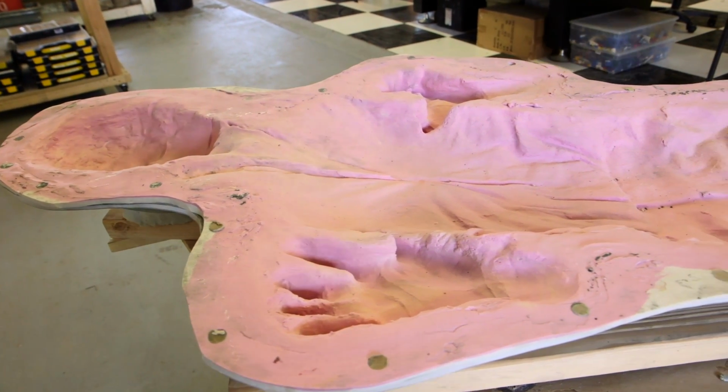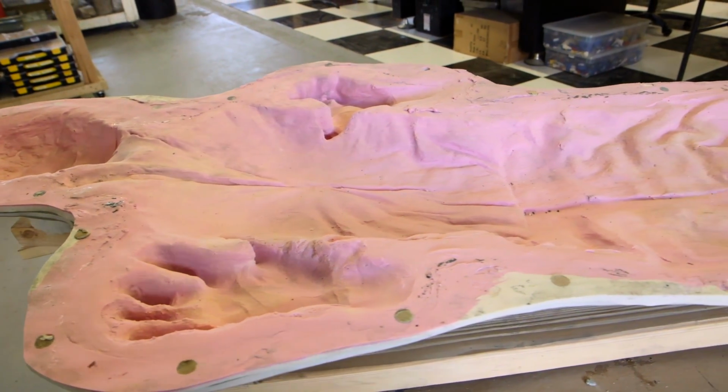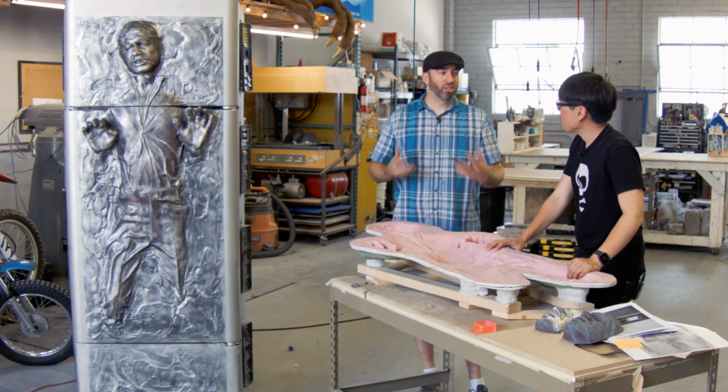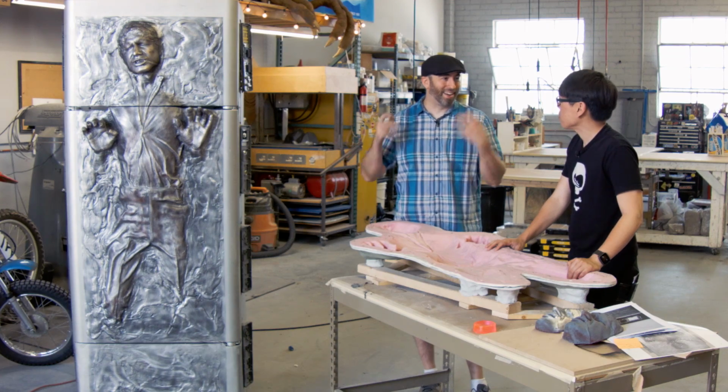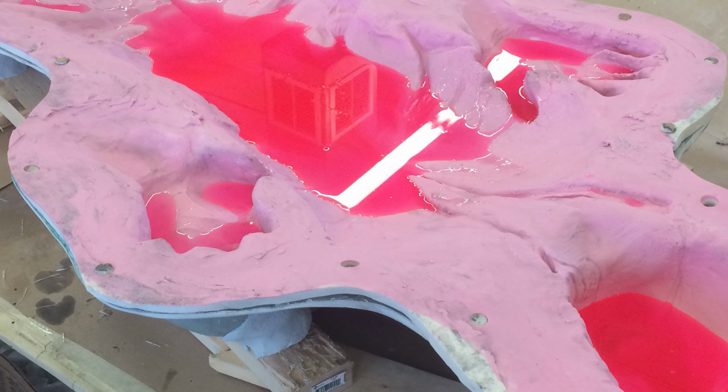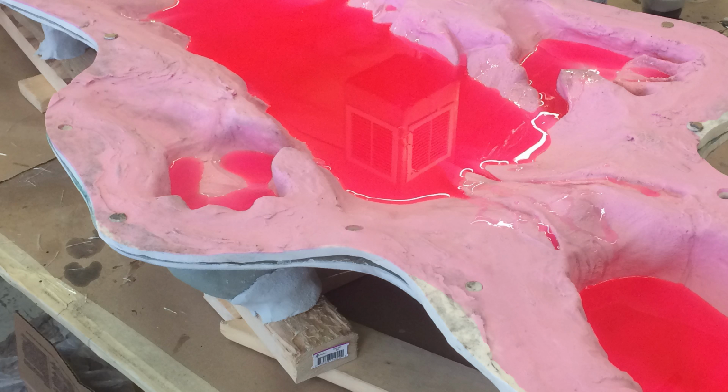Yeah. Well, we made a quick mold of all the parts that I got, and then we cast it in a clear epoxy, because originally I was just going to do it regular Carbonite, and then I was like, nah, this thing needs to glow. So I tinted this Epoxicast 690 a little bit pink, so that when it glows, it's got this real nice bright red. And then we filled it in layers in the mold and then embedded LEDs in the end.